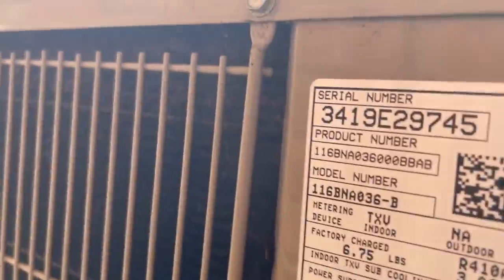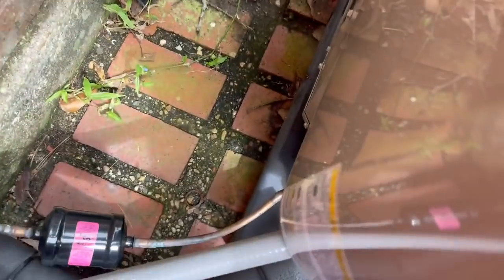All right, here's our unit — it's a 16-SEER Bryant. We're waiting on the thermostat. Oh, I can hear it humming. I've killed the disconnect. These are very nice units, but if you don't change the capacitor at installation, you will be back within a year. And I can see it — it's swollen.